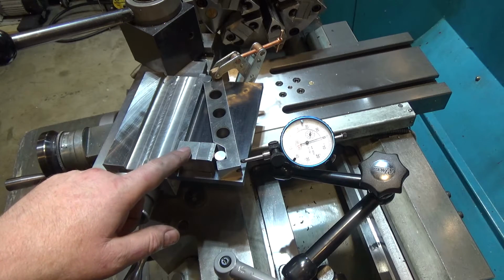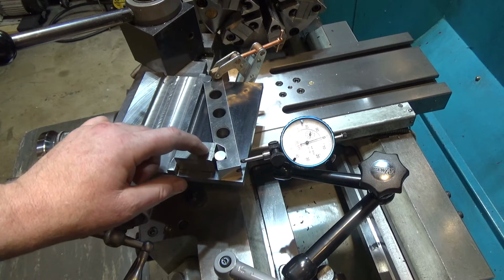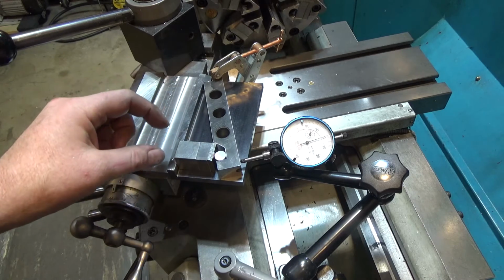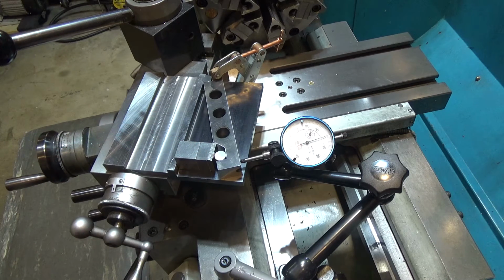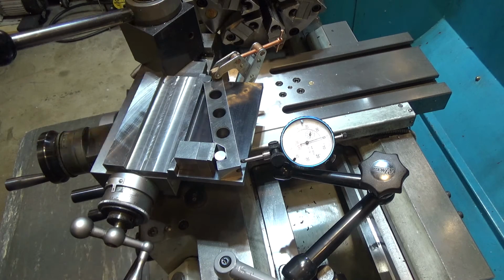When your gauge stack starts to get small, like I'm actually considering this, your gauge block set won't be able to easily make that value anymore, especially if it's less than a tenth of an inch on the stack, because the smallest gauge block is 50 thousandths typically, but then the ones that have incremental changes all are by the 100 thousandths. And so if you need less than 100 thousandths, it's probably better just to make your own custom gauge blocks. What I probably will do is machine a moderately accurate, within a couple thousandths height on a piece of bar stock, and then head over to the surface grinder and grind it down and measure with calipers until I get it right on, and use that to set my sine bar.